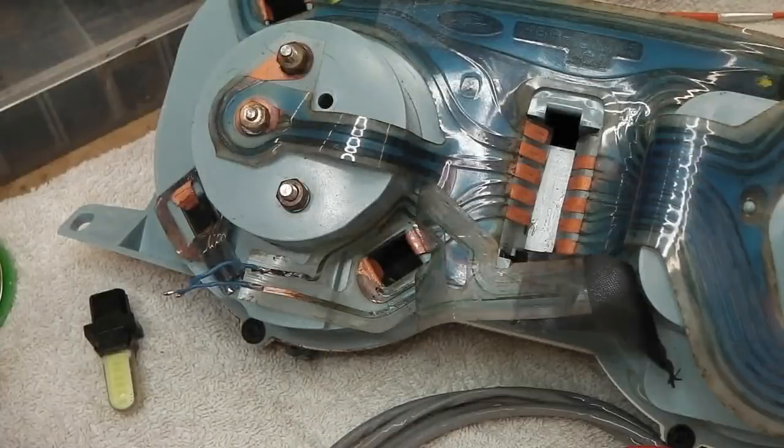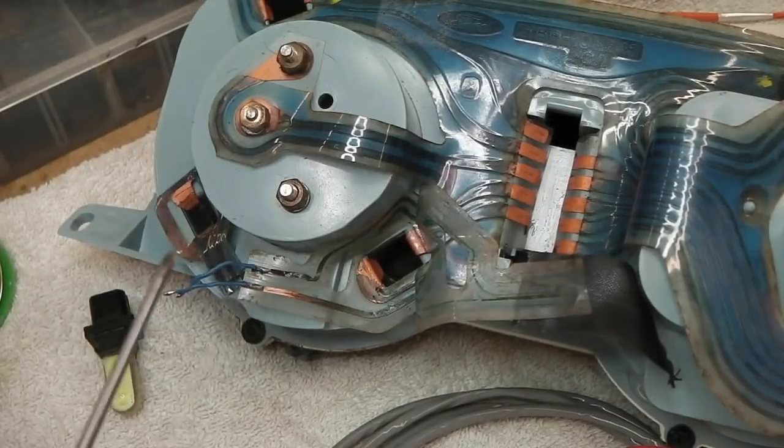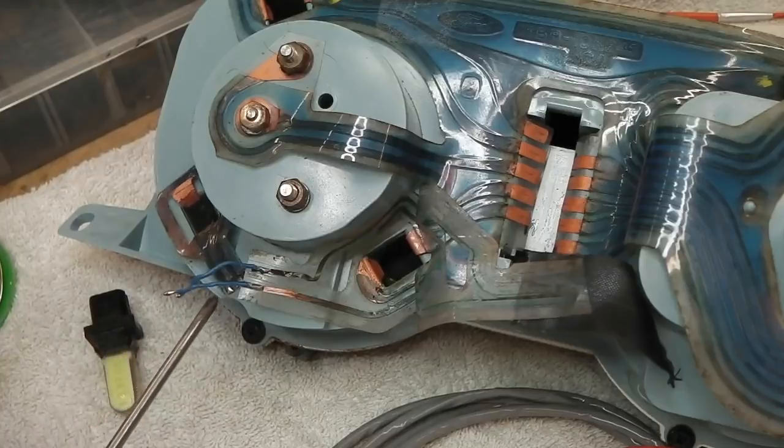A delicate repair coming up. We just peeled back the damaged area of the circuit board here. Cleaned back with a little bit of acid and then neutralised it. Soldered two little jumper links on. Then we've salvaged a little repair pad from another clock. Cut it, tinned up the ends of the copper tracks, and we're going to make these little jumper links. They'll just connect the two together.